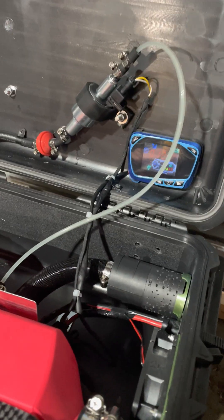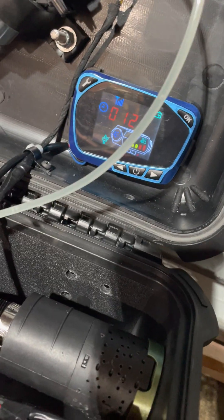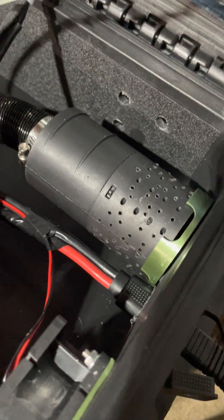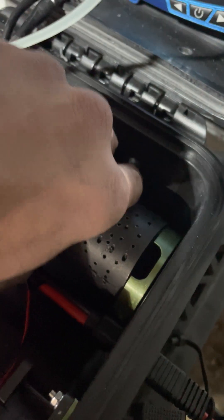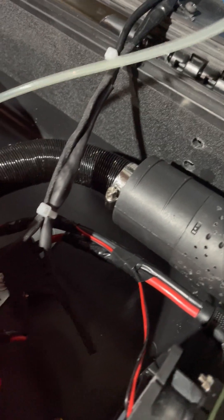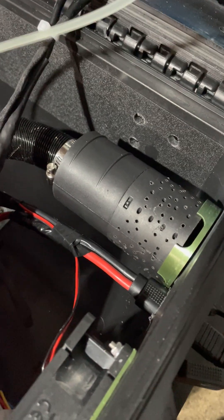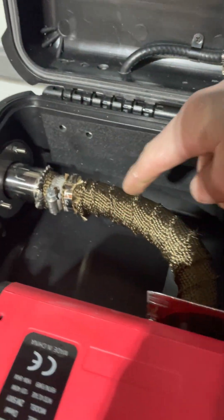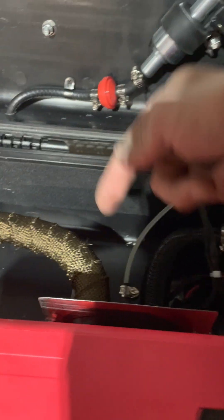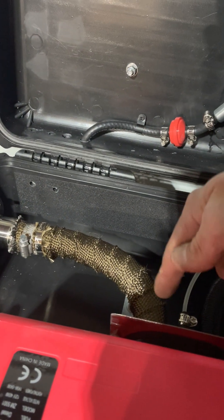The blue controller is the new controller. This air intake is just a plastic piece with a bunch of holes drilled in it. Since some holes on that end get a little covered up, I drilled some more holes and then took a chunk of open-cell foam and shoved it in there so it actually has an air filter — hopefully catching dust or ants or whatever before it gets in the intake. The exhaust tubing has a sleeve on it — check his video for the parts. I wrapped motorcycle header wrap around that sleeve.